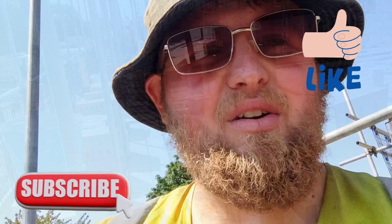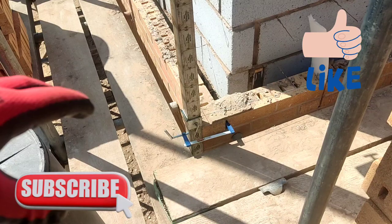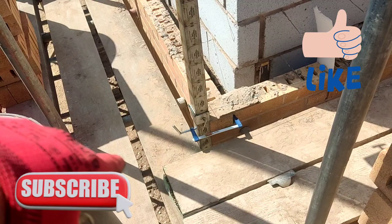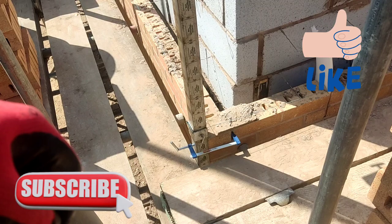So we've got a normal profile clamped on. I've got some of these, the Nielsen ones, but they're cheap, they're affordable, and they do the job at the end of the day. There are more expensive options out there, but they do the job. That clamps onto one brick. Ideally that's a 150 clamp, but you want a 200 for a bit more leeway, because 150s only fit if it's exactly 150, and sometimes a brick can be a bit thicker or thinner and it doesn't fit.